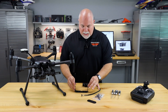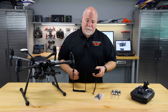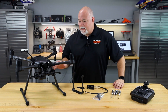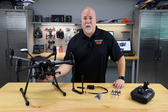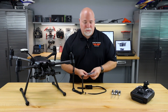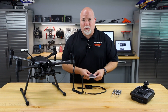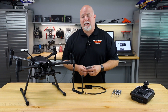What we're actually going to do is take the main mount and the quick release bracket that's also included in the kit, mount that to our drop system, and then using a quick release thumb screw we'll be able to take this on and off to get it into our case. Keep in mind you are going to have another bracket on the bottom of your M210, and while it doesn't take up a lot of room, you may have to alter your case slightly. Also in the kit you're going to get all the hardware you need along with a couple of Allen wrenches. They do give you two quick release screws as well as some zip ties to tidy up that connector on the back.